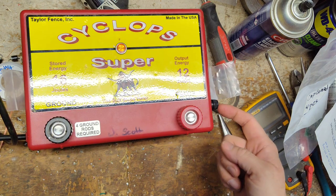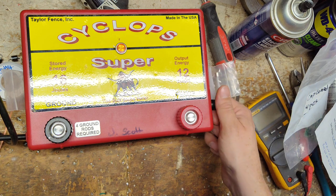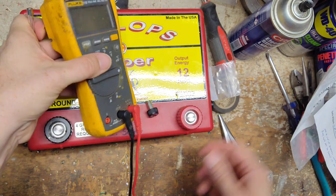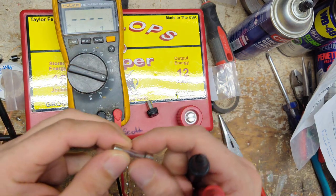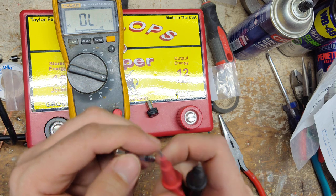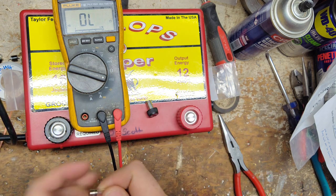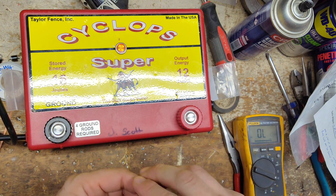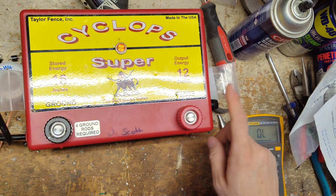The first thing you'll want to check is the right-hand fuse. This ties into your fence and ground side. You can push and turn the cap off and look at it. It may look good, but every once in a while the little filament inside will look intact in the glass part but it'll break on the inside of the silver part. So the best way to know if it's good is to use an ohmmeter set to continuity and test it. If it tests good, the fuse is probably okay. If the unit clicks and does not flash with no fence hooked up, the first thing to do is check or change that right-hand fuse.